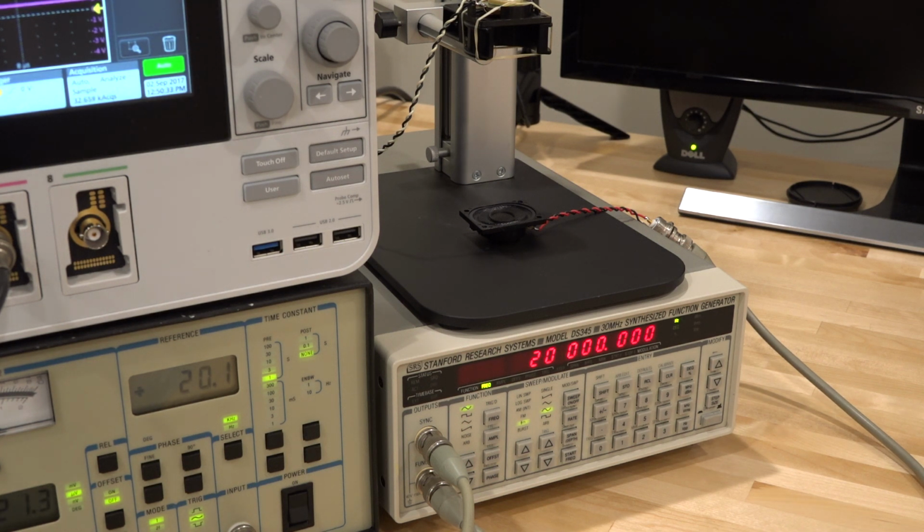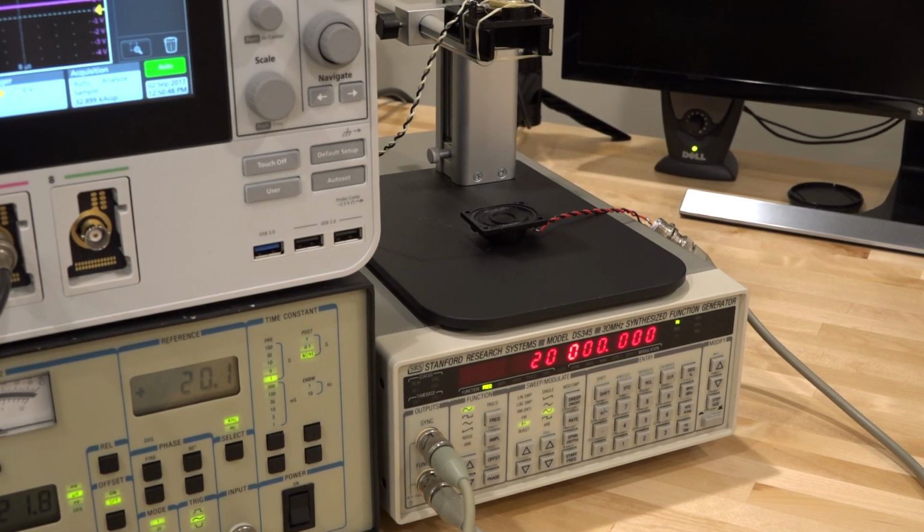So the gain is going to be much, much lower than it would be in the frequency range that they're designed to operate. But that's okay. We're using a lock-in amplifier. The signal can be very small, and we should still be able to pick it up without any issues at all. So I'm quite happy with that. I have no problem with that part of the frequency choice.